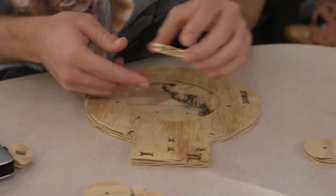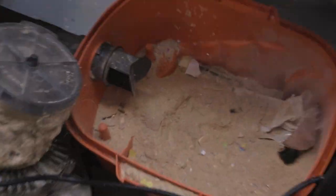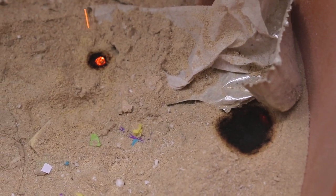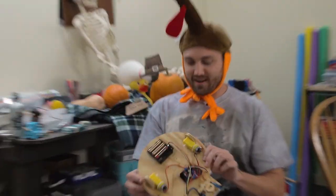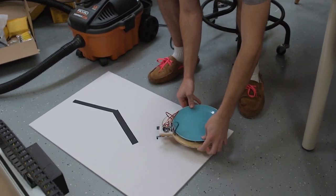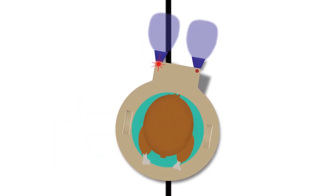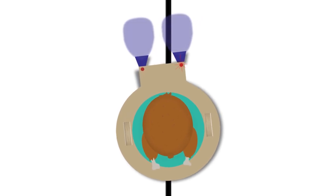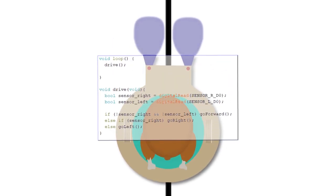This is the top, the plate goes here. We got ourselves a little vacuum cleaner fire — this is scary, like a trash fire that smolders and you don't catch it till later. It's done and it works! The electronics are wired up, I wrote the code — we didn't do any of that on camera. Put the plate on it, put it down and watch what happens. You have two sensors, left and right. If the left sensor crosses the line you steer left, if the right sensor crosses the line you steer right, if neither crosses you keep going straight. It's literally like 20 lines of code.